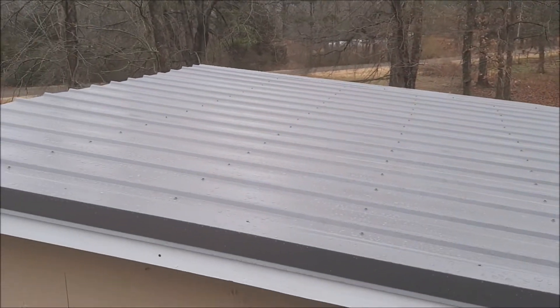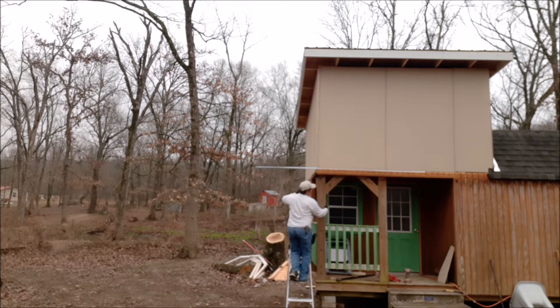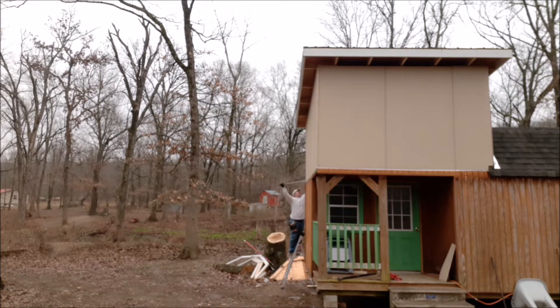But it is looking gorgeous. This was really tricky to do — to try to slide this in after we had already installed the siding. But it was getting late and we were trying to accomplish something and make use of a nice day. So what I had to do is loosen up a few screws and slide this in. This Z-Track, if you don't know, I also use this on my storage building. It is like a Z-shape. So if moisture comes down the siding, it keeps it from going underneath the next section of siding to prevent rot. So it's a safety mechanism. We got all the Z-Track up, all three sides. I didn't have it the other day and we were tired. It was late. I always slapped all the siding up, but we knew we could always come back and slide it in there.